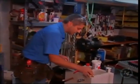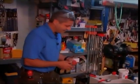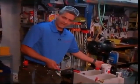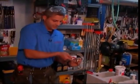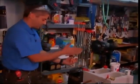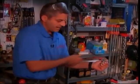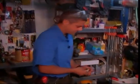Now, where's our shutoff valve? That's a gate valve, no good. Let's do the nice one. It's bad enough we got a gate valve on the outside. Let's use a nice ball valve on this side. And always remember, here's the water flow. The handle's in the direction of the flow. Opposite of the flow, you've got it off.